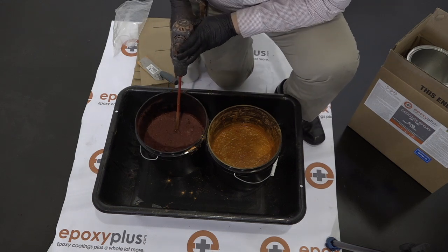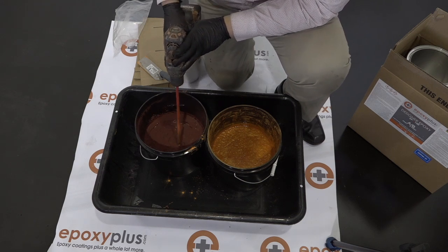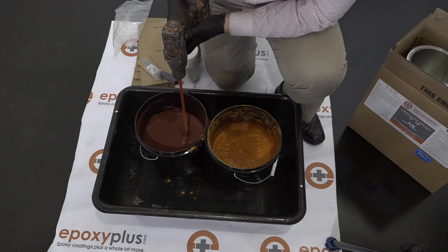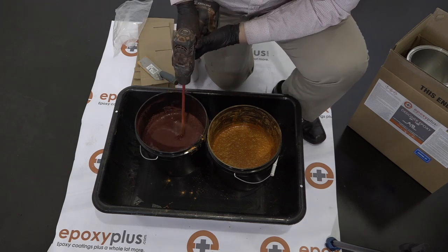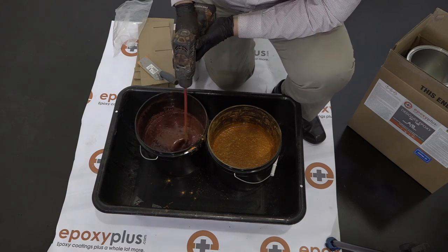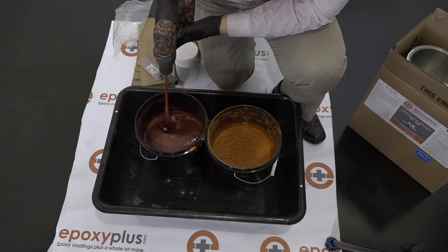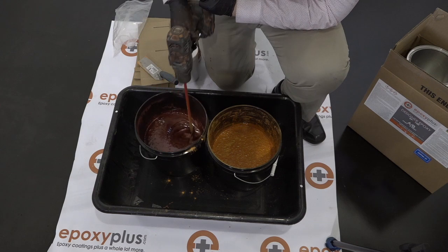And we know that this is really quite boring, but we feel that it really helps to enhance the look of the floor. We get the pigment dispersed properly into the material, and we're eliminating one of the causes of the little comet tails or streaks that we sometimes might find in portions of the floor. Many of you may know what I'm talking about. Mostly they're caused by dirt on the floor, but it can be caused by unmixed or improperly mixed pigment.